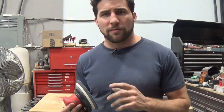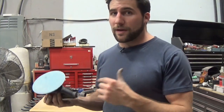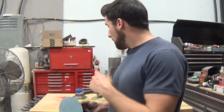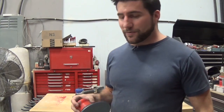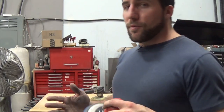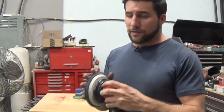That brings me to my favorite style of sander for finishing work — essentially the same thing, but if you follow my channel you've probably seen me use this one many times. It's a dual action orbital sander: moves around, spins, not very aggressive. These are pneumatic, whereas the ones at the beginning were electric. You can change the air settings to make it more or less aggressive — mine are set around half, so if I add a little pressure it's not going to keep spinning or tear away a bunch of material. It's got a nice soft pad on it, which helps you get into edges and curves. It's very controllable and fits in the palm of your hand.